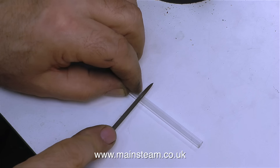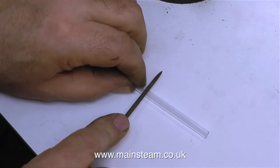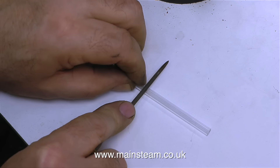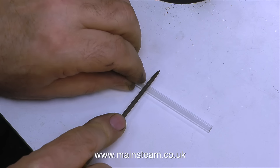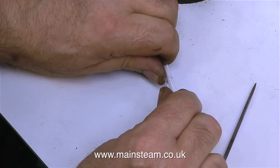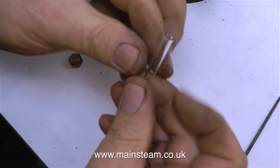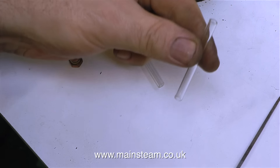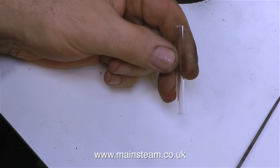In the previous clip, I marked the length of glass that was required, and now I'm using the edge of a needle file — in this case one of the sharp edges of a square needle file — going all the way around the glass and scoring it. There are other ways of doing it, and I'm sure all the experts will let me know, but I do it this way and it seems to break quite cleanly. Health and safety warning: you should really wear PPE — personal protective equipment — in the way of something to protect your eyes.